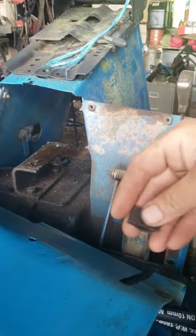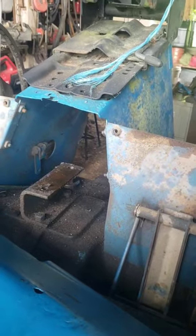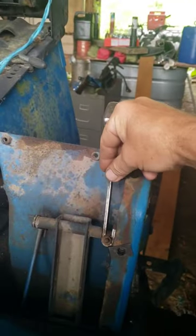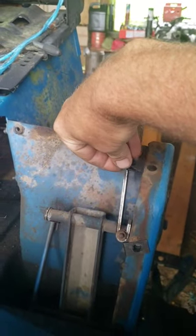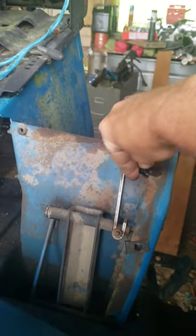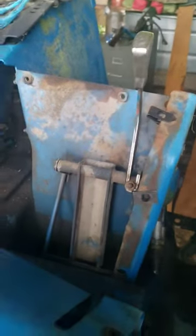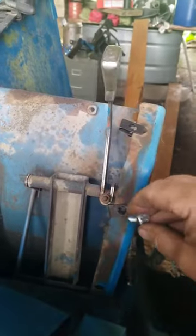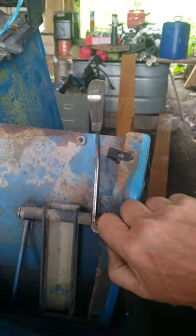What happens is you take the extruded part and put it below where your panel is. It would slip on like that. You'd push it over with a pair of pliers just like this right here. Now you put your panel on the front. You don't need a wrench behind it. And your bolt just screws into it.